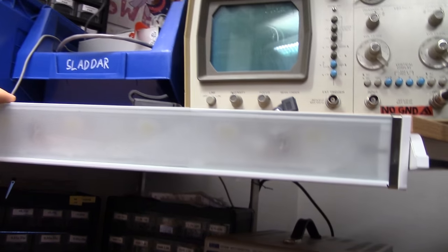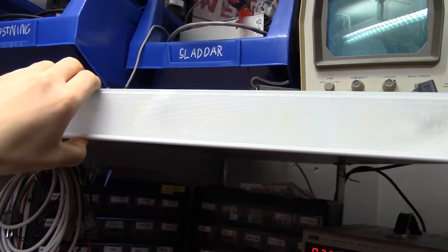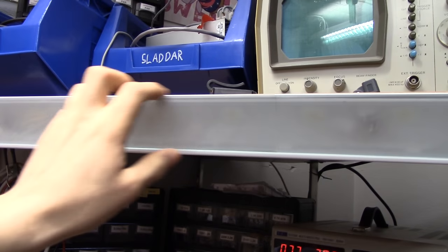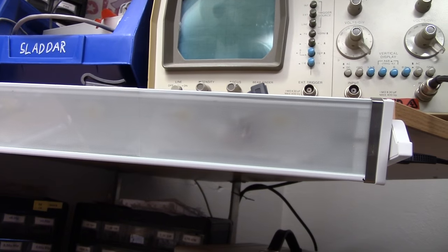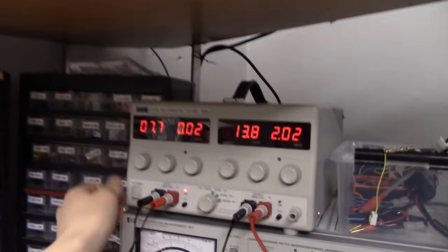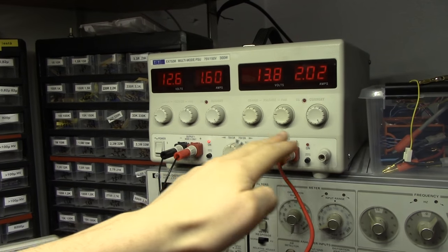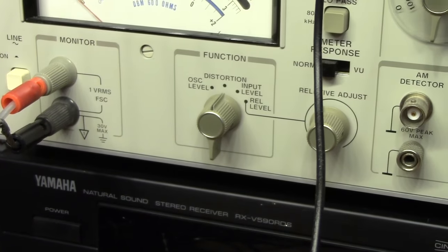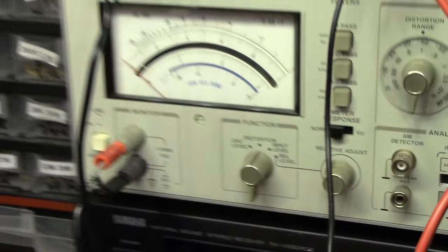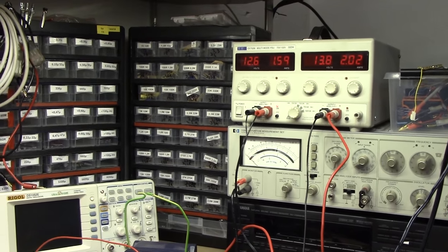Just a quick postscript: I noticed after assembling it that it really provided some quite spotty light. So what I did was cut out a piece of LCD diffuser film and installed it behind the glass. Now it's really got a quite more even spread of light. In its original incarnation you would have extremely sharp shadows underneath all the components, and you kind of still do have that to an extent, but it's nowhere near as bad as it was. This does come at an efficiency cost, but I really think it's worth it since the quality of light is significantly improved.